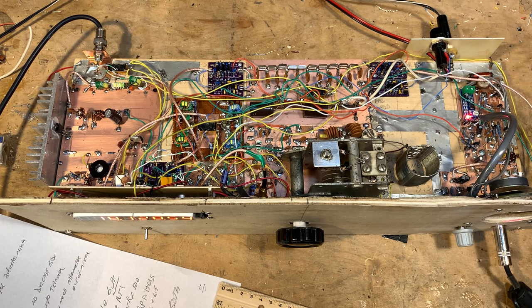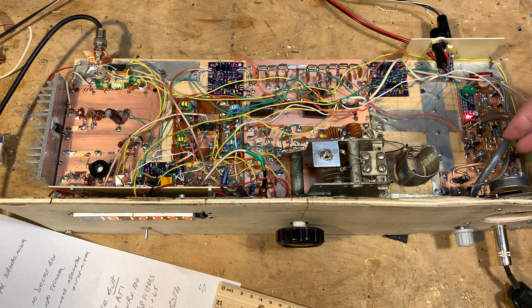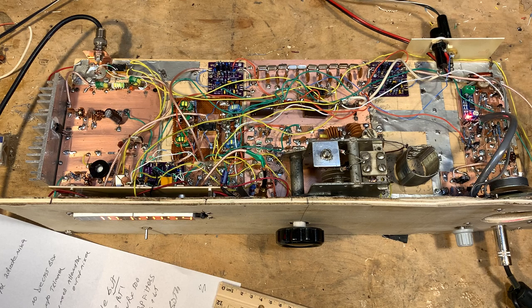This is not the kind of project where I'd supply somebody with a schematic and a bill of materials — it's more a 'this is how I did it' project. You could try to build your own. The only information really applicable to other projects is that for 17 and 12, the crystal IF frequency of 21.47 MHz seems to work fine — I don't detect a lot of birdies or other spur problems — so this might be a good way for somebody who wants to build a 17-12 rig. I have an internal three-inch speaker, positioned to keep metal away from the coil, and I got it from Adafruit through Amazon. It works fine.